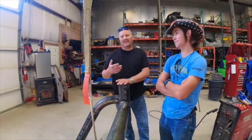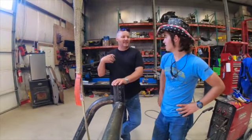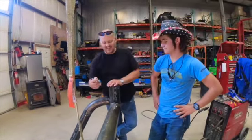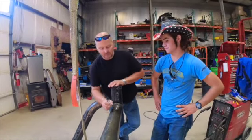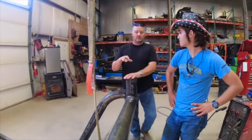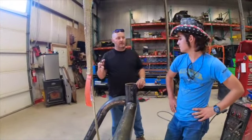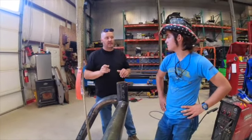My nickname should be Overweld. Actually, we should do a shirt like that — Overweld. You should just print that on a welding jacket. So what we need to do right here: make sure that when you're grinding it down, you keep the arch of the pipe and you don't flatten it off. So grind it down a bit and then use the sanding disc to clean it up.